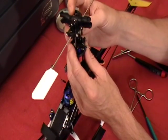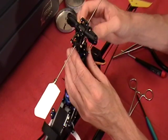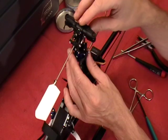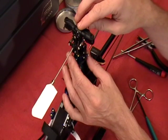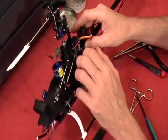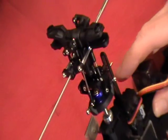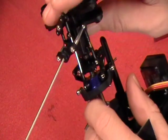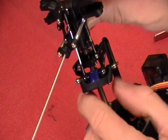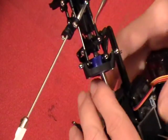This middle component in here and the anti-rotation guide, they hit at about the same time, so there's maybe a little bit of a trick to it, but it's not that bad. They're on. Now I'm going to insert the shaft into the top of the head block, and that's done. What I am going to do, zoom in so you can join me on this, we're going to back it up just a little bit, because now I need to find my hole in my main shaft.